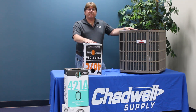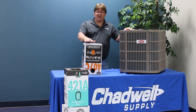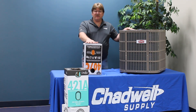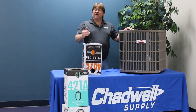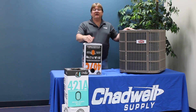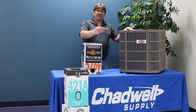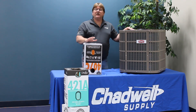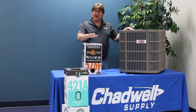This refrigerant has advantages in many markets. The biggest advantage is in applications like 30-ton package units — for example, Walmart has decided that when they retrofit a system, they switch to 407C. With a 30-ton package unit in a controlled environment, you can actually drain the compressor because those units have oil drain plugs, making oil changes simpler. In our residential market, it's not so easy since smaller compressors don't have oil plugs. If it's so labor intensive that you're not changing compressors, it might not be the best route. But if a company has dictated 407C to you, remember that new compressor changeouts will already have the correct oil — only flush the line set, no extensive oil flushing required.